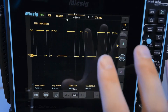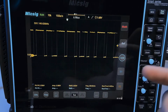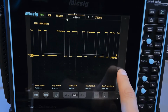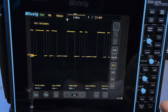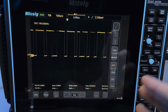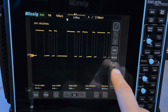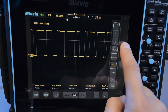and we can try serial decode. So to access serial decoding, I would flip up on the channel menu, and now I have math, reference waveforms, and the 2 serial decoders. By the way, you might be wondering what this level thing is in the middle. If I click on this, it's actually just the trigger level. That's all that this is. And if I pull out on this, then I get a quick trigger menu, which also gives you your oscilloscope mode, including normal mode, if you know what that is, or auto mode, where you have forced sampling. Normal, when it only samples on trigger and nothing else, of course. And then you have, do you want to trigger on a rising edge, falling edge, or both? So really cool. And then which channel is being used for triggering. So very actually convenient and very fast to access. And here's your actual trigger level, which you can set here.